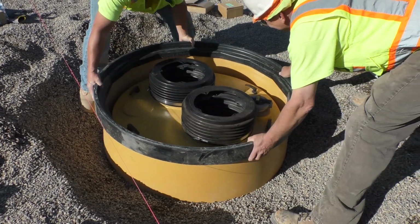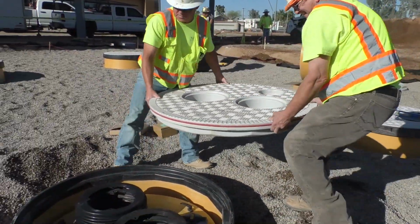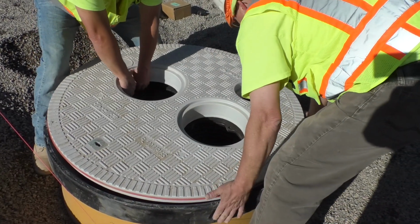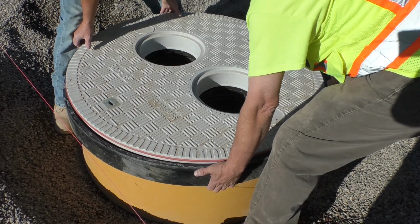Once the shroud platforms are installed, the FO100 multiport cover, frame, and skirt assembly can be installed. Place the multiport cover into the FO100 frame. It is a good idea to clean and lubricate the frame prior to installing the multiport cover so that the cover fully seats down into the frame.